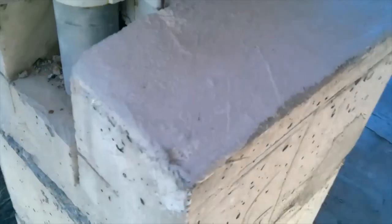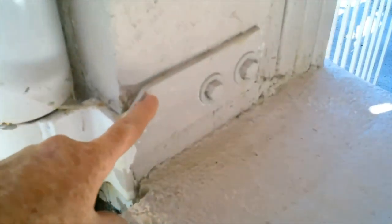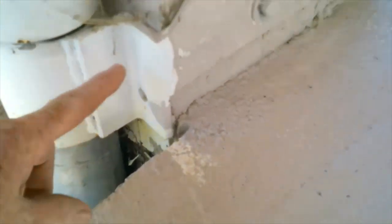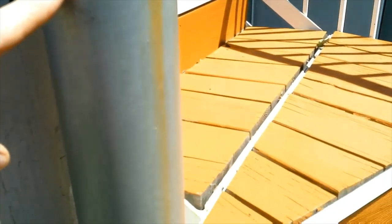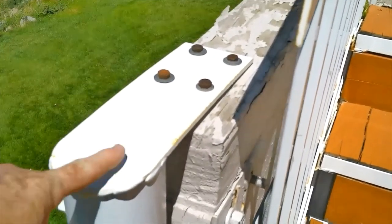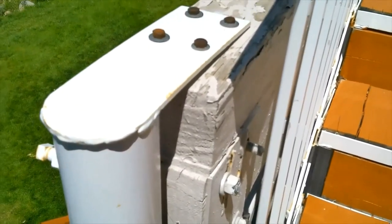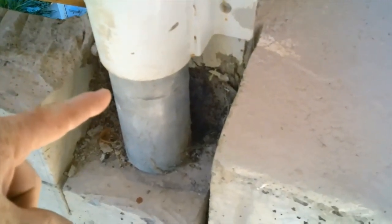The main support for this structure down on the bottom level had to be cut away to accept a pole which was galvanized. This pole right here is held in with this particular bracket and it's fastened to the main 10 by 10 that goes from the ground level all the way up to the second level here, and it's tied in to this glue lam right here. So this goes all the way through the staircase holding everything into place. This pole is attached at the top with this bracket, attached midway with this bracket, and rests down here on the deck foundation.